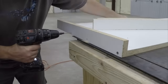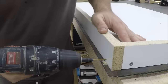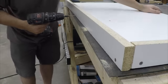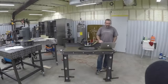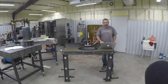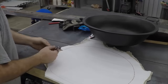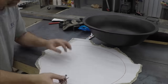We used some inch and five-eighths inch drywall screws, pre-drilled for those, and then ran them in with an impact driver. Then we needed to cut out for the sink — this is a sink I had ordered for this specific project, and it was going to be an undermount sink. So we needed to cut out a foam knockout to allow the hole to be created in the concrete for the sink to go into.